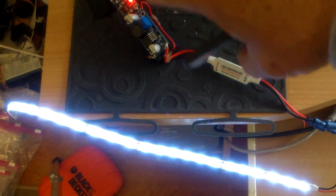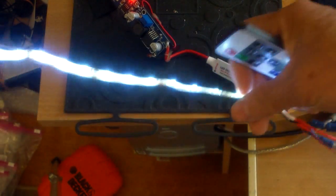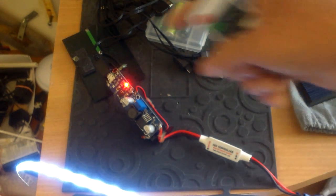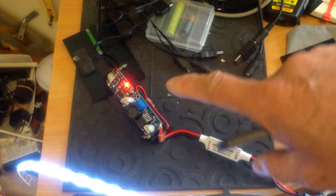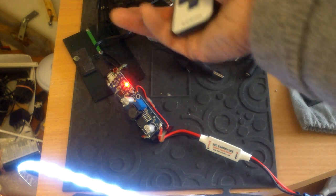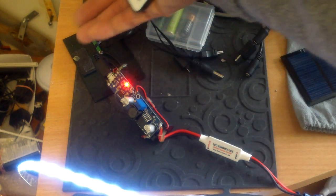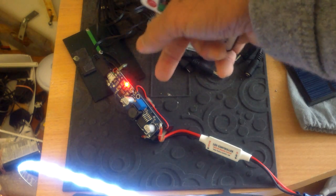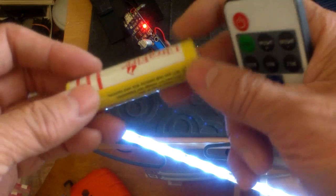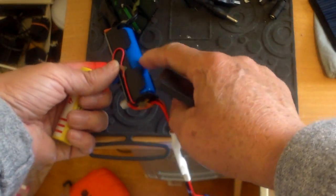Right now I'm just using that single battery. Since this is still experimental, I'm going to see how it recharges with that single solar panel — 6V, 100mA — which is not really enough. If you boost the current to 12V you lose half of it, getting about 50mA. I'm boosting a 3.7V battery to 12V so it's not going to last super long. This battery is rated at 5000mAh, though there are mixed reviews online about the actual capacity.